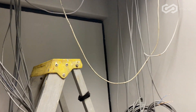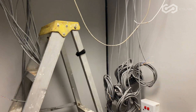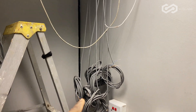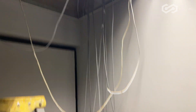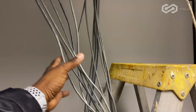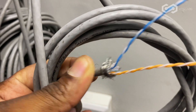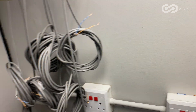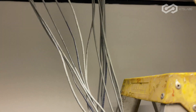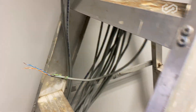You know, the access points — I'm going to go through the patch panel that I showed you, one over patch panel, and then from there into the same VLAN that I will configure for the access points. And then into the switch. Making significant progress. This one here is a Cat5 — it's not for the camera. For the camera I'm running Cat6 shielded — full shielded cables through the walls and ceilings.